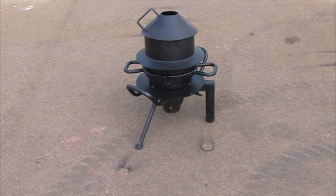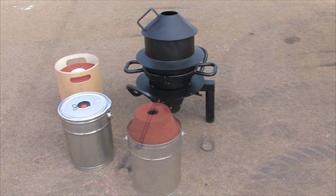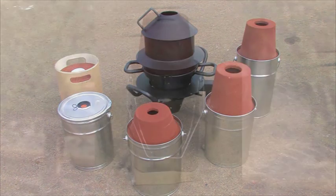Which consumables and equipment are needed? First, a reaction crucible. Independent of welding process, different crucible systems are in use, either single-use crucible, one crucible for one weld, or long-life crucible, one crucible for several welds.